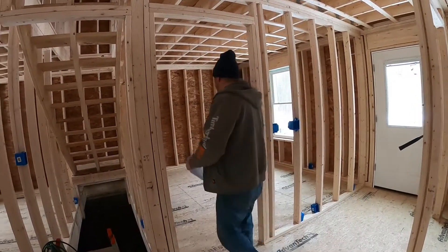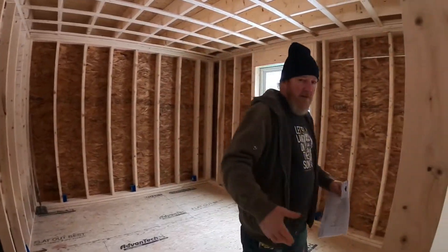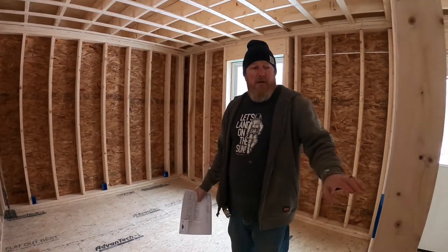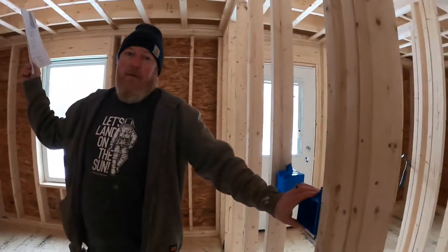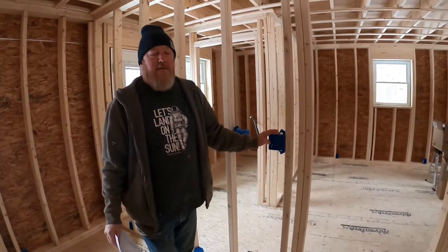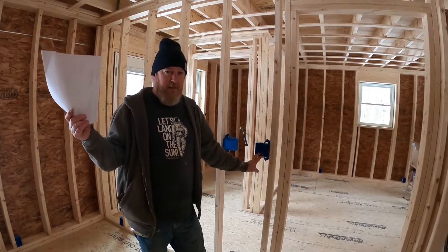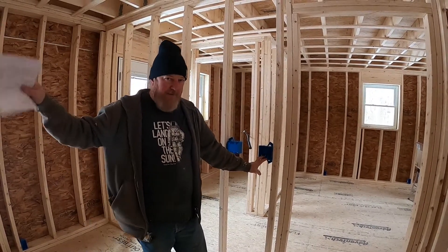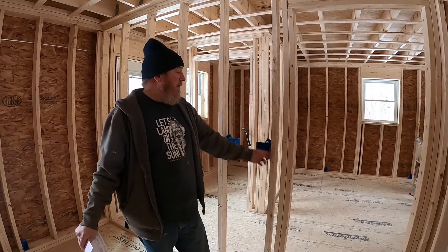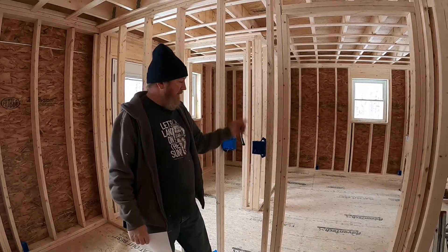Here's a regular 12x12 bedroom. We know there's a ceiling fan going in the center of the room. When we wire houses for ceiling fans, we always put two switches and run 3-conductor wire up to the ceiling fan. That way you're not pulling chains — you have one switch for the light and one for the fan.